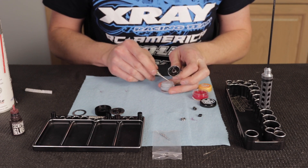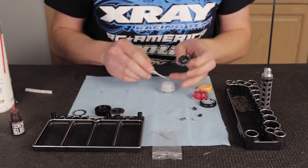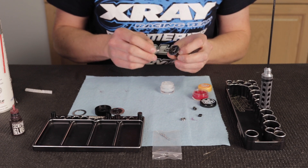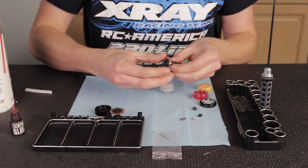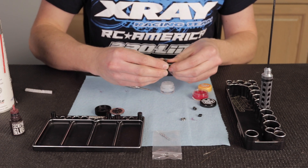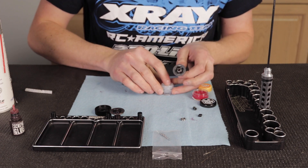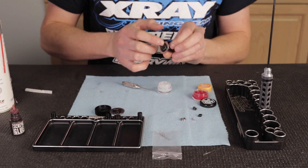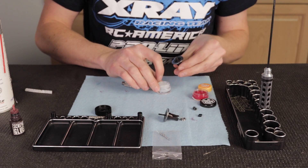If there's a bearing on each side, I'll do the other one in the middle. I'll put the grease on again — this is just something I like to do, it just makes it a little easier to work with. I'll push the ring on there, wipe the excess off around the outside, and then put a little bit on the face of it as well, just to make sure there's a lot of lubrication between the ring and ball. I'll do the same thing to this side.